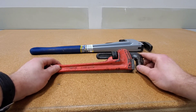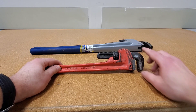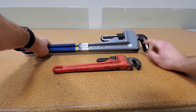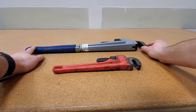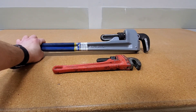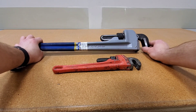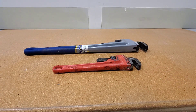One other thing to take note of, and this is for all reputable pipe wrenches: here you have a pin, and here you have a pin, which means the bottom jaws are removable. If you want to take off the top jaw, all you have to do is keep spinning this, and then it will come out and you can replace it. Because these teeth will wear out, and the teeth are very important because they bite into the pipe so you get a nice, strong grip.